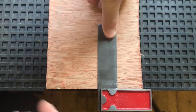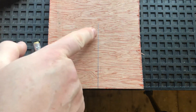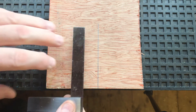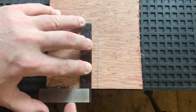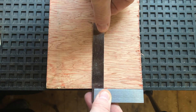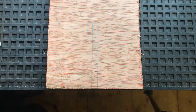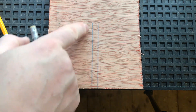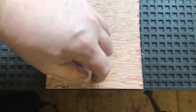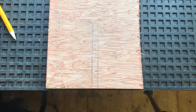Turn your square over, find the exact mark, and mark yourself a line there. On the smaller ones it's hard to see, but there's not much deviation — this one is pretty good. This is the one I bought yesterday: push that up to the board, mark a line coming down, flip it over, mark a line coming down there. You can see they're together at the bottom but out by a millimetre at the top. That might not seem a lot but if you square that up it's going to be well out.